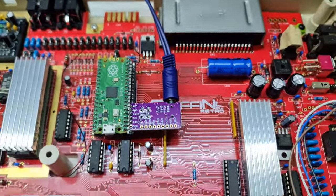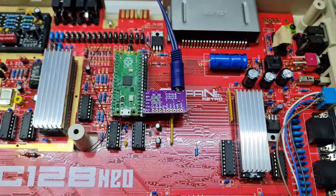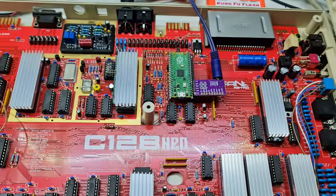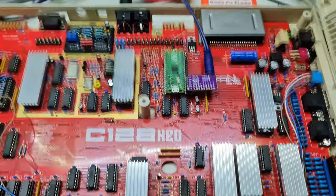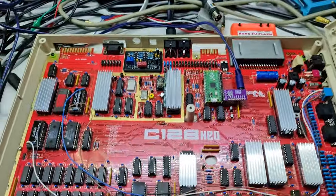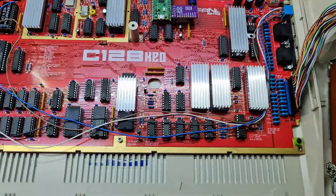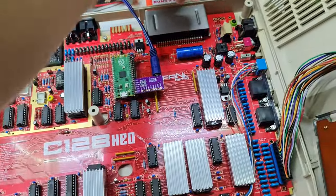I've got a 3.5mm jack cable plugged in. And that's just going to the PC so I can record it. Now, the firmware allows you to use both the 8-pin AV audio jack on the back here and the DAC at the same time. Albeit at a small reduction in quality for what comes out of the 8-pin. And for me, that's perfect. Because what I'm going to end up doing is I'm going to end up putting some ports down here.